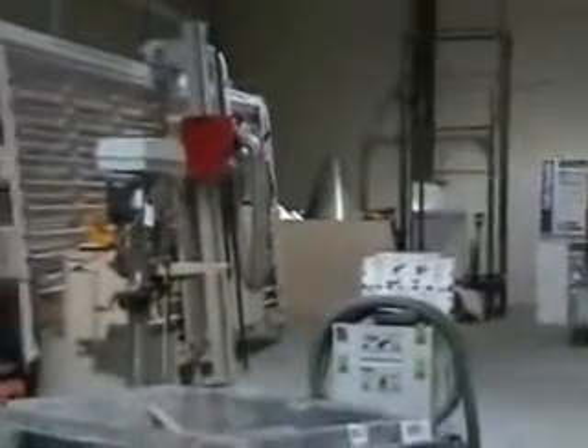These fabricated metal pieces are for the dust control system. That frame holds the cyclone system — we have a double 55-gallon drum connection and the filter tubes will hang on there. It's been sized for the average number of running machines in the shop. The machines all have blast gates so unused machines can be shut off and active ones can have their blast gates opened.